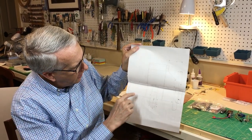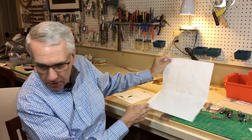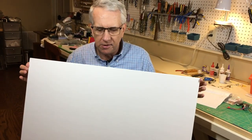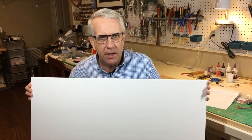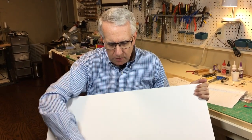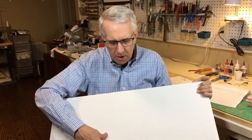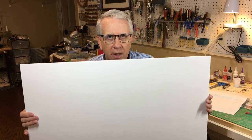The reason I use 30 inches of wingspan is the width of the foam board. So this will be the width of the Bronco. Again, this will make it simple because I don't have to make two halves and put it together for dihedral. The tail booms, the pod, etc., will just be drawn onto the foam board from the plan, cut out, and put together with hot glue. So again, this is a simple, affordable foam board Bronco aircraft.